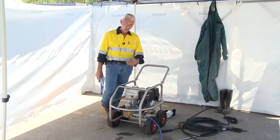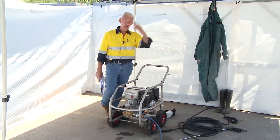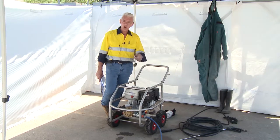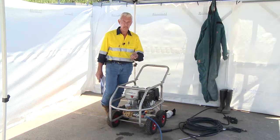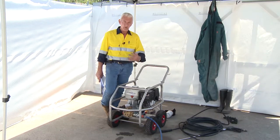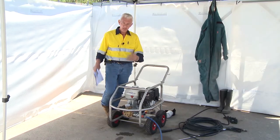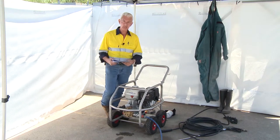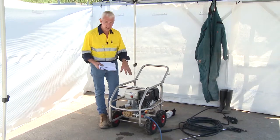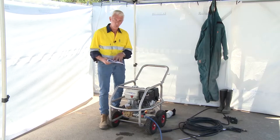As far as the environment is concerned, not only the water runoff but also the water vapour and mist you create can enter items that should not accept water, such as cable trays and electrical equipment. It's important you understand your environment prior to commencing a job. Do I need to isolate things? Have I read the JSA written for that particular job? There should be a specific job criteria in relation to water jetting.